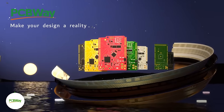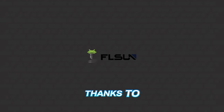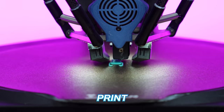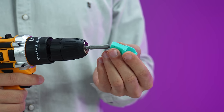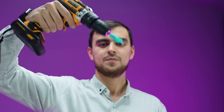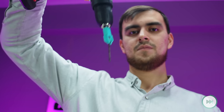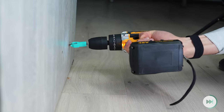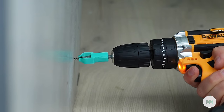Now we can continue the video. It took about 9 minutes to finish with the V400 — thanks to FL Sun for providing it. Make sure to print the model horizontally, otherwise it will break easily. This is the screw claw — it helps you manage a screw with one hand without it falling off the bit, which is always a pain when working alone. Place the screw claw on the front of the screwdriver bit and insert the screw. The screw is held by the clamp and does not fall down, even if you hold it upside down. Super useful idea.